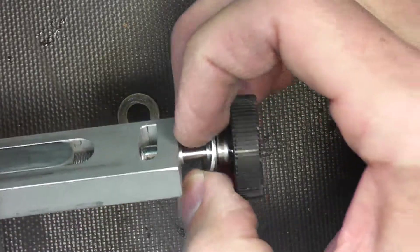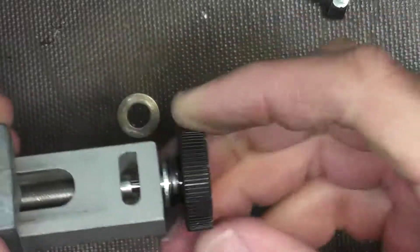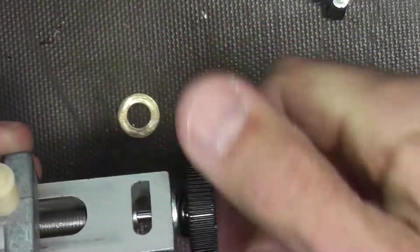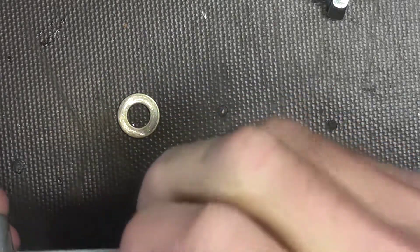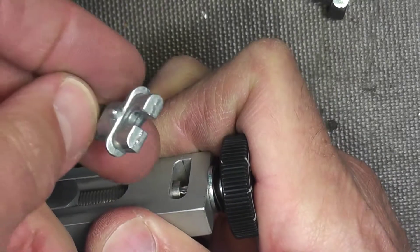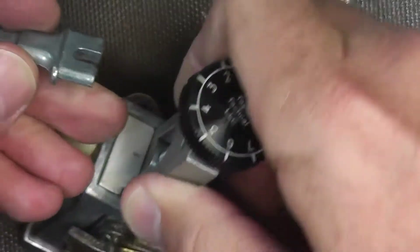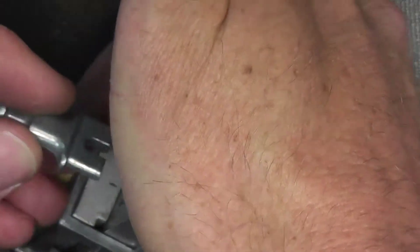So then we're going to pull this down to the end of the screw and push it. We need to overcome that spring tension right there. There we go. So I'm going to take our keyed component here — it actually turns this way. To get some pressure on, I'm going to turn it upright and push straight down with my palm. I didn't screw down far enough — there we go. That's giving me the spring-loadedness I need, and we're just going to press that in there and it fits right in place.